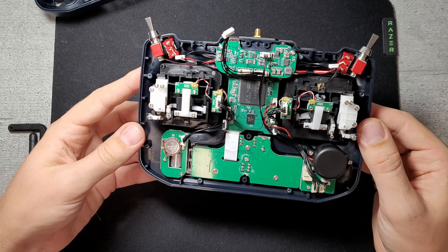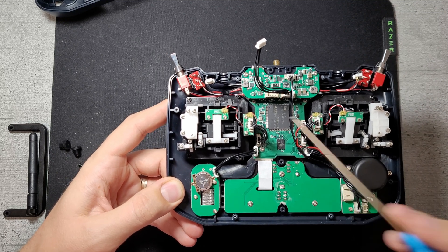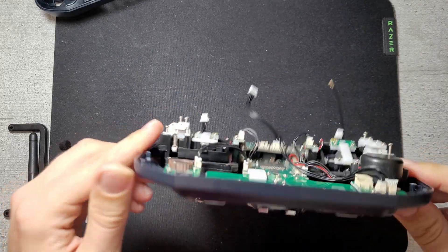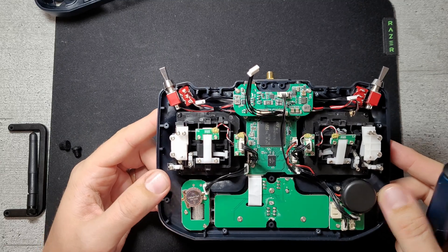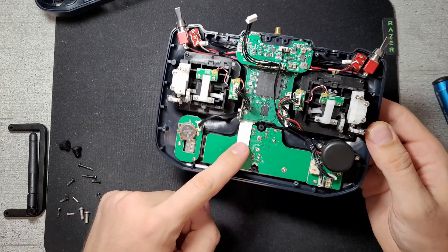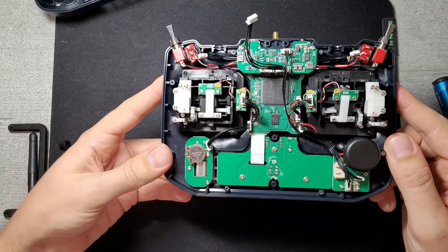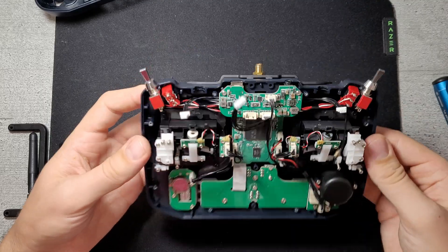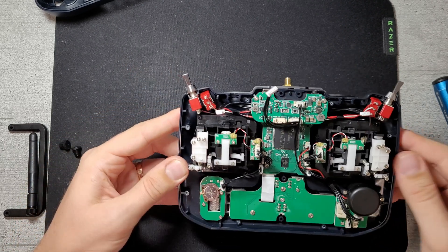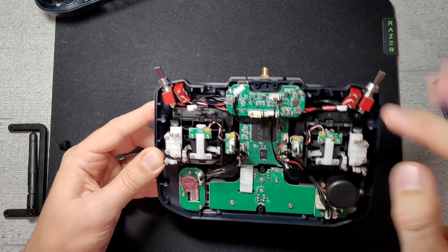What's really interesting is it doesn't have an SD card or micro SD card — I only see a small flash chip and the internal flash of the STM32 microcontroller. That's quite a big difference from any other ELRS or OpenTX radio. Other than that, there's one small ribbon cable for the button connectors, the metal scroll wheel, battery cell connections, and the gimbals — which are basically the Jumper T18 gimbals — quite sturdy and fine.